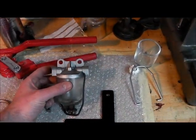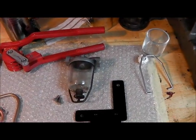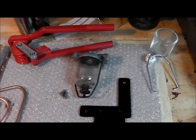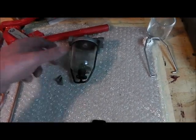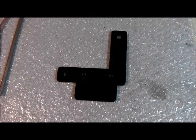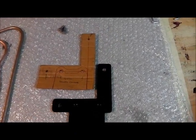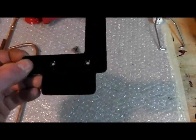The difficulty with fitting this is that I don't want to drill holes in the bulkhead of the car, and where it actually wants to sit — where there is clearance for it — it would sit a bit funny as there's a join on the bulkhead. More to the point, I want to use existing bolt holes. To that end, I've made up this little bracket which started out as a bit of CAD — cardboard-aided design — and progressed to a drawing and finally a nice little bracket with some riveted-on captives.